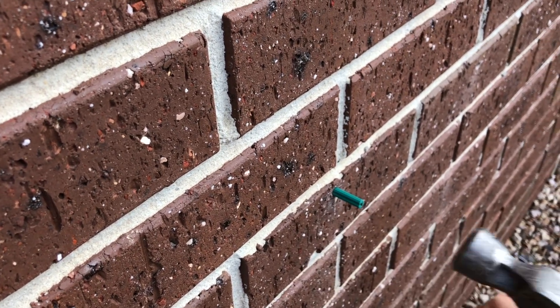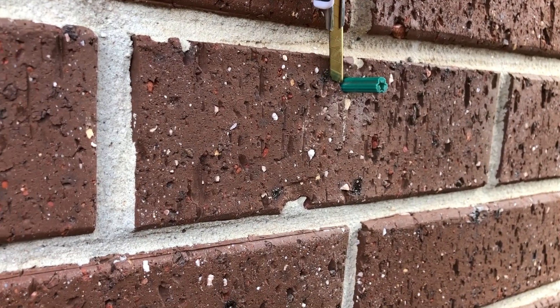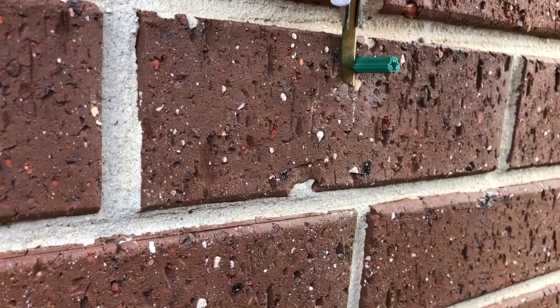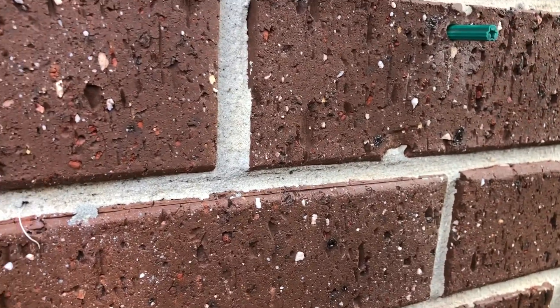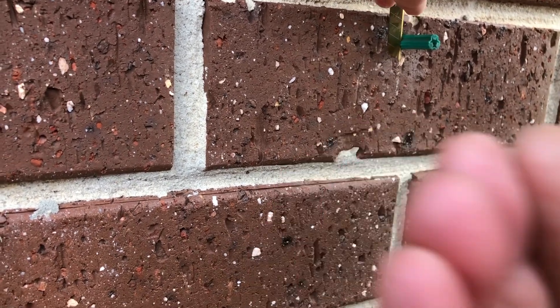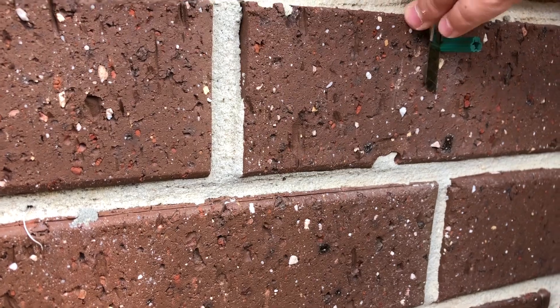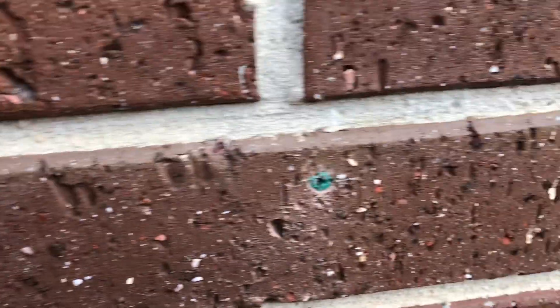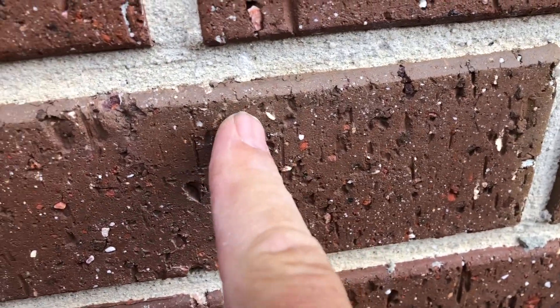When it comes to a stop you'll hear a different noise. Simply get a sharp knife and chop it off, getting it as flush to the wall as possible. You can pull it out a little bit, cut it, then bang it back in — if it sticks out it'll hold the fitting out from the wall. There we go — one in, and two in. I just took the bit we chopped off and stuck it in the second hole.